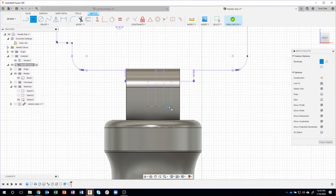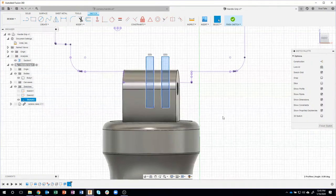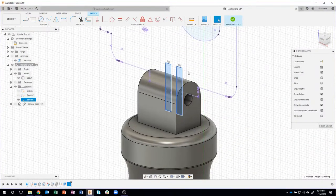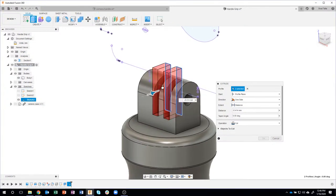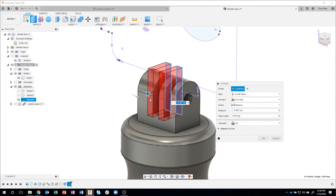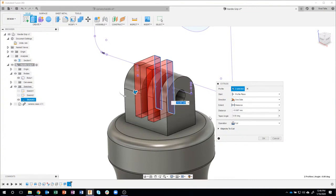So for example, you'll see I'm going to create a rectangle and I can catch to that corner there. And I'm just going to drag up and draw a rectangle like so and draw another rectangle like so. It doesn't even really matter how far up they are, but all I care about is these rectangles, these grooves, I'm going to machine through our standoff. So again, I can right mouse click, say extrude, and if I start to drag, you'll see exactly what's happening here. We're taking the information from the camera case and we're going to create these grooves. Now a question I get quite often is, well, how far do you need to extrude? Well, in this case, I could snap to a particular face, and it will snap to that face.